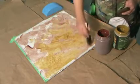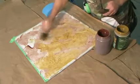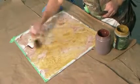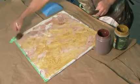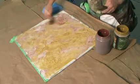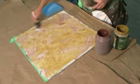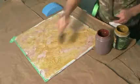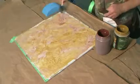Versi-Plast and glaze, or distressed plaster as it is often referred to, is a 4-coat application which gives you an aged relief plaster effect. This coating is an acrylic and glass sphere composite and will not crack or shrink. Also unique is that Versi-Plast does not require a primer or sealer and is therefore ready to glaze when dry. Versi-Plast is a white plaster product which can be tinted to any color. It can be used to render a vast variety of textures and can be painted, glazed, carved, or treated with metal reactive paints for an amazing effect.